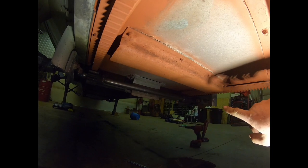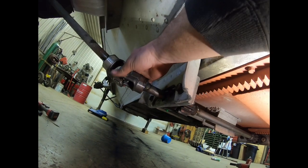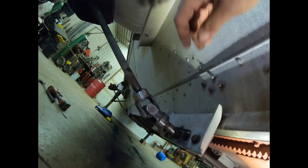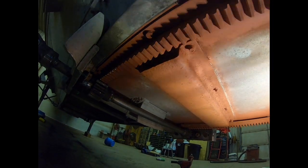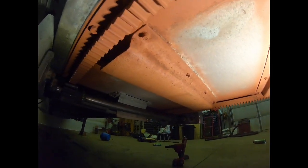The door's all reassembled, everything's put back together, the gears are all welded to the shaft. One thing to point out when you're welding these u-joints: only weld on two sides of them and don't get them extremely hot. If you get them too hot you'll end up melting the rubber out of them and the grease will drip out. We're gonna paint everything really good under here — paint the shafts black like they used to be. You can crank it open now with one finger, no struggle — we've had them open and closed a couple times to make sure everything works.